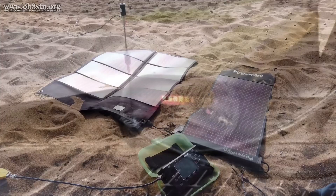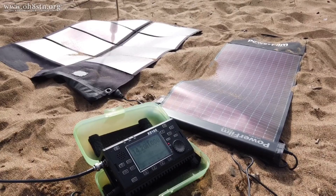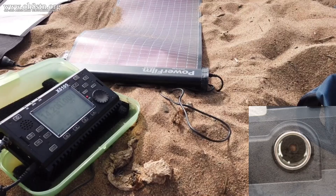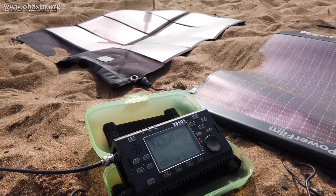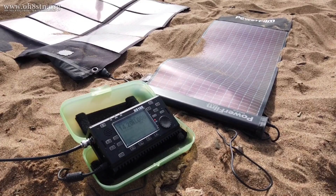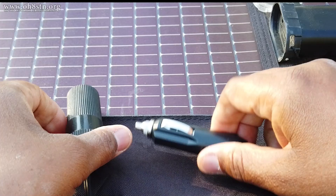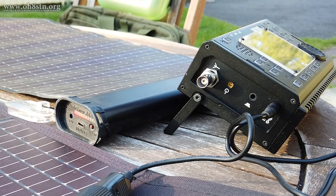The DC port is located just next to the battery status and charging indicator. Recharging is a critical aspect of field operations, especially extended field operation. The Lightsaber Max can be charged, or simultaneously charged and powered up, through its USB-C port using your car's accessory outlet, a power supply, or by daisy-chaining the Lightsaber Max with another solar panel. In this example, I'm daisy-chaining the Lightsaber Max with a 20-watt PowerFilm panel. From the 20-watt folding panel, I use its Delphi connection and the cable which terminates as an accessory socket. I take the female accessory charging cable included with the Lightsaber and plug that into the accessory socket, then plug the other end directly into the Lightsaber Max.